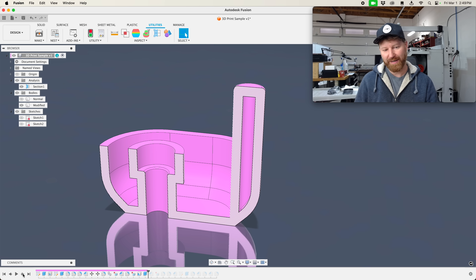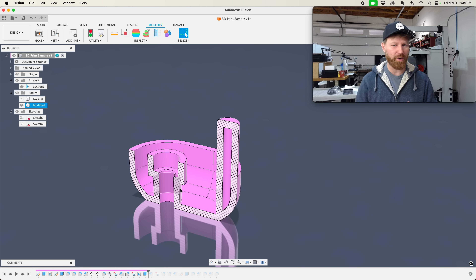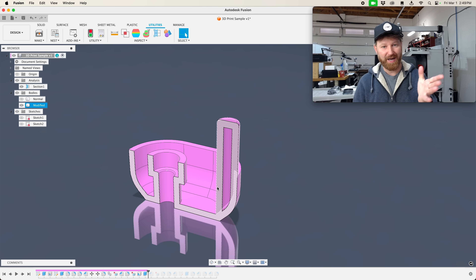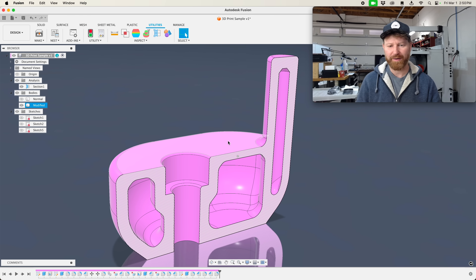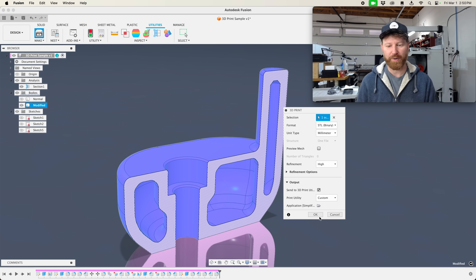You're going to save a lot of time here. But if you had other features — maybe the part was squeezed or under torsion — you can 3D model any kind of support you want on the inside, and it will be printed like a wall or shell and give you a lot of strength. This is not just for bosses that come through layers; this can be added anywhere through the part. For wall thickness, we chose it by taking our 0.4 mm nozzle times however many shells we have, whether 8 or 6 — and that goes for the top and bottom layers too. We added radii everywhere to make sure all of those breakpoints are as secure as possible.